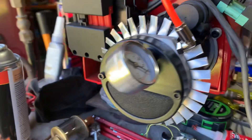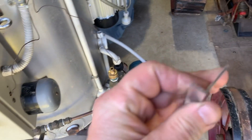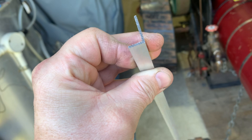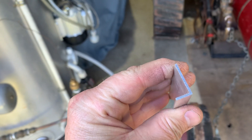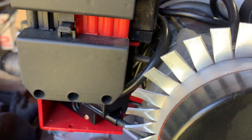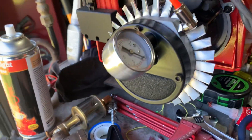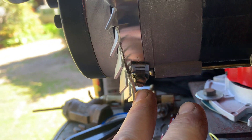The solution was to put cooling fins onto the compressor housing. To do this I used aluminium angle, available from most hardware stores — this one is 10 by 25 millimetres. You measure the circumference of the pump housing and I ran 10 millimetre intervals for where the cuts were to go. I used tin snips to cut the fins into slots in the angle, and then it very neatly bent round the compressor housing and was secured with a stainless steel hose clamp.